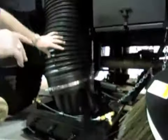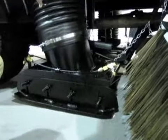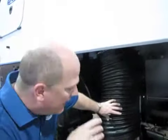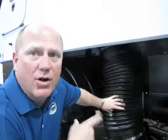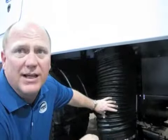The sweeping head has a 14-inch blast tube and a 14-inch suction tube. You've got five water spray nozzles around the head for fugitive dust control. One of the features on this machine that is really new to our market is we have added a hydraulic curtain lifter that we've been using in our Australian market with really great success for about the last five years.